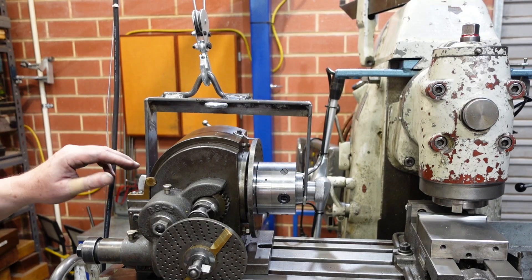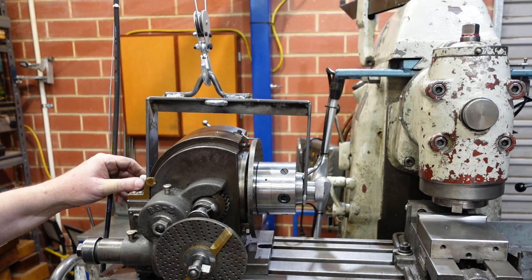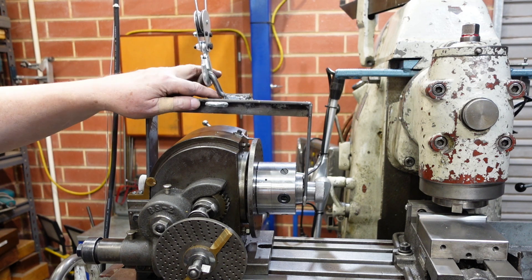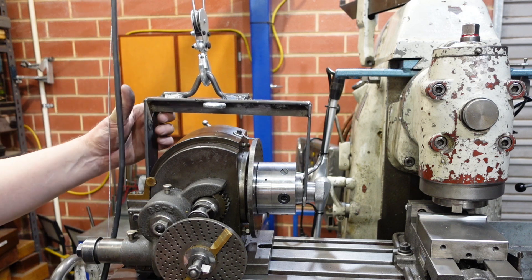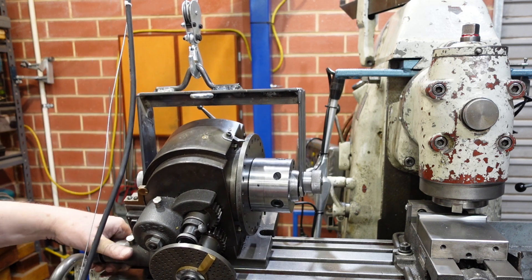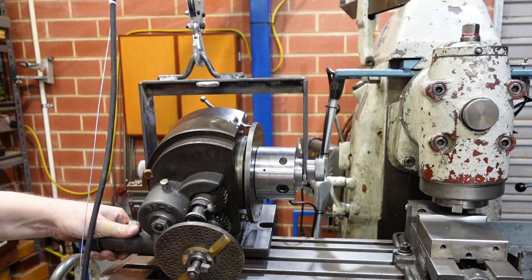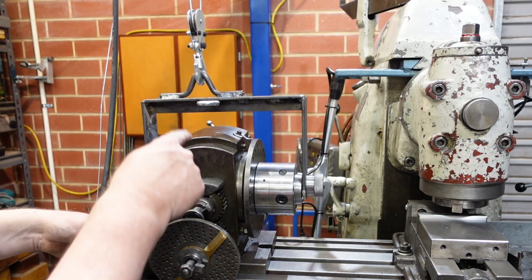Finished item. I've knurled the end of the knob there — since I've got a knurl to help my grip on one end I might as well have one on the other end of the pin too. The lifting loop is positioned where I worked out the center of gravity was, and I've put a loop on there for a strap. If you notice, it's now lifting level, so I've got it in pretty much the right position — I just need the strap to keep it level the other way.